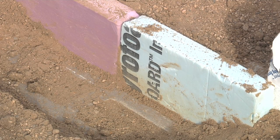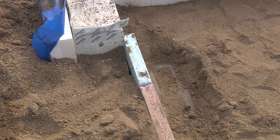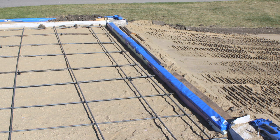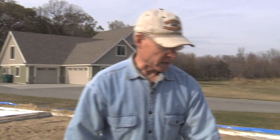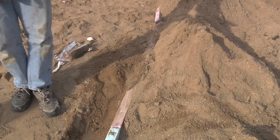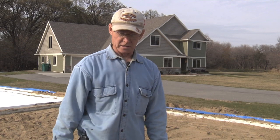The foam will be set down about an inch and a half from the top of the concrete, then we'll have a treated lumber on top of that and half-inch nylon sheet on top of that. That whole wood structure in the concrete pouring phase is wrapped in poly so we can pop that board out or replace it if needed. The board gives us a structural material to attach the nylon sheet to, we have a durable surface, and we can trim it with industrial caulks and sealants. It gives us a nice durable thermal break, and the outside driveway apron will actually sit on the foundation wall — so we won't have that apron settling on us either.